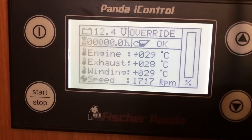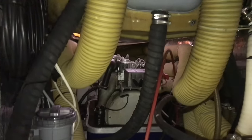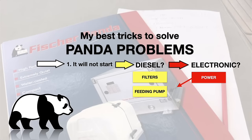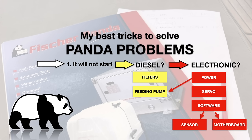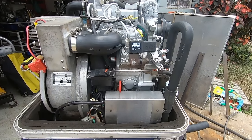If it still doesn't start there is another thing to check. With filters changed and even the feeding pump working, it's time to check the part I hate the most on this generator: the electric computer-controlled servo that controls the throttle. This acts on behalf of the software together with the motherboard and sensors. Sometimes this can be stuck in the wrong position — it's like trying to start an old engine while your stop handle is still out. This servo is like what you find on remote-controlled toys and it controls the throttle via a link. You can try to start up and see if it's moving the throttle. If it didn't move, you can motivate it manually by moving the servo to start position. I can almost guarantee you that your Panda will now start.